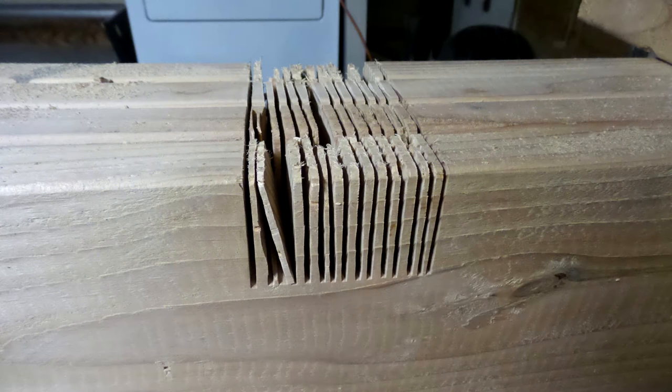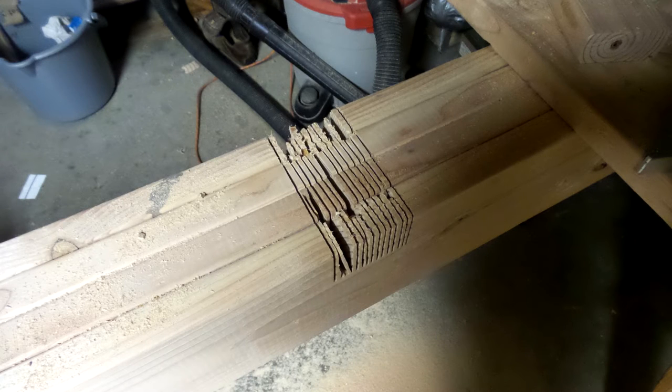With the depth of the circular saw still set to 2.25 inches, cut many little grooves in between the two lines we cut with the guide. You do not really need the guide to cut these, as they do not need to be perfectly straight.